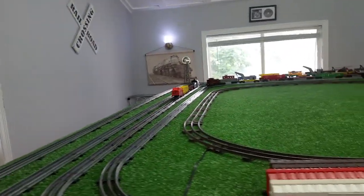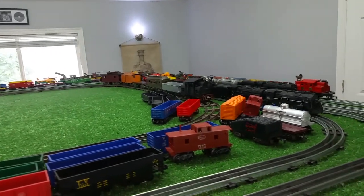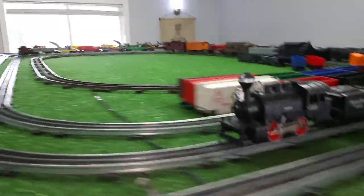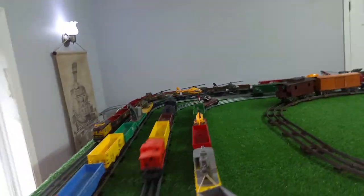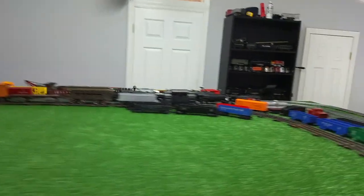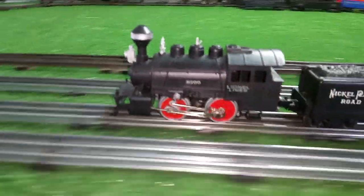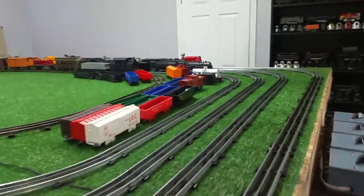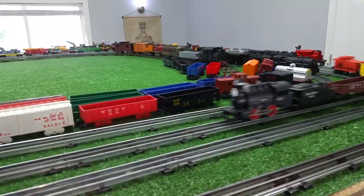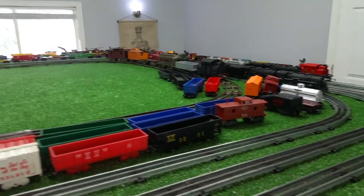The grand total to add that diode was maybe 15 cents — I got six of them for two bucks. That runs just absolutely splendidly. I'll pull the motor out, solder that diode directly onto the motor, and from then on it will be an AC locomotive. This works on any DC locomotive — you reverse the leads and you reverse the direction. You gotta admit, that is a really cool looking little locomotive. It was cheap, nobody wanted it because it was DC, and just by adding that simple diode, it is up and running on track power. It does have a traction tire on it, and of course it was designed to run on DC.